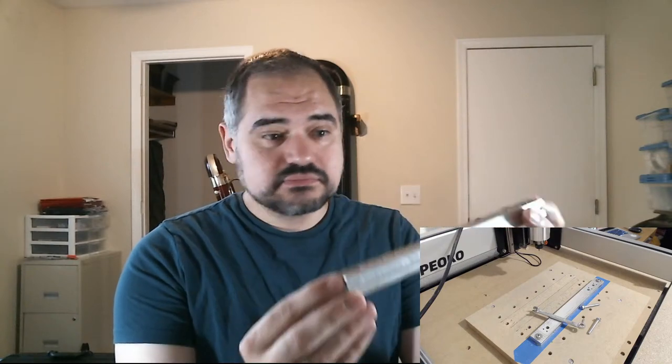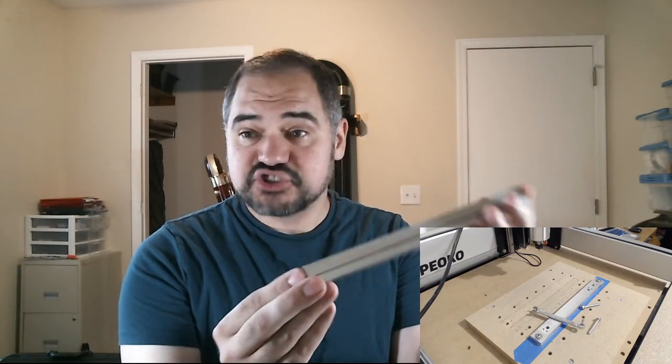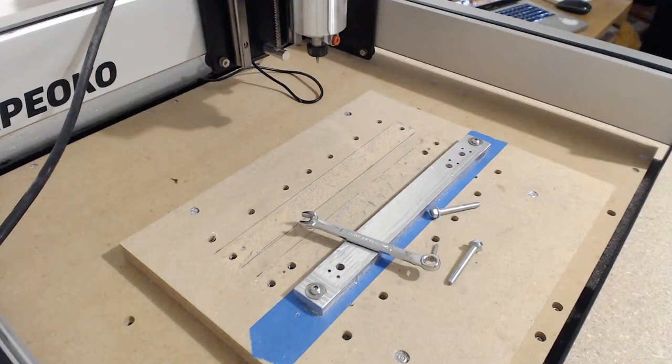But let's go ahead and get the process started, and then while it's machining, I can talk a little bit about the process. So I'm going to run to the garage, taking this shaper blank, and if you look here, you'll see this is the setup that I have going on. I have a plate that I'm going to be mounting these plates to. I also need to indicate it so that I know that it's in the exact correct position. And I'm going to go start doing that now.